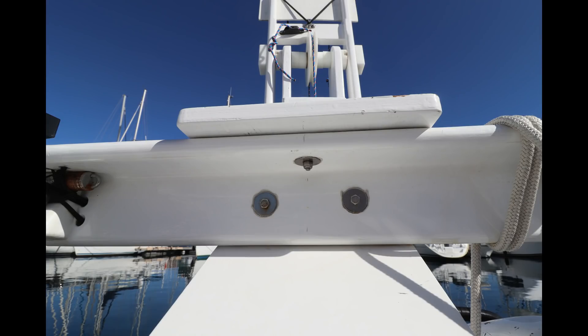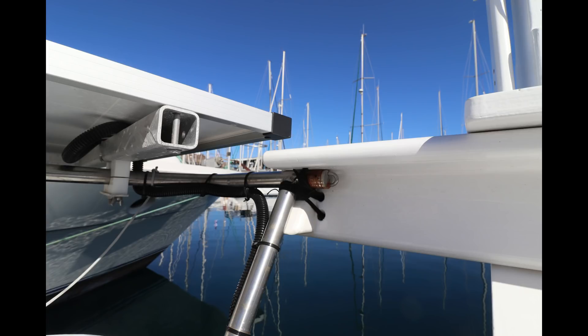When I purchased Wave Rover, the push pit didn't have a continuous bar across the back. So I fabricated a piece of wood and covered it in fiberglass cloth. The base assembly is now through-bolted to this piece of hardwood, which is in turn connected to the push pit by lashings. These lashings are made out of lobster twine — a polyester twine we have locally in Prince Edward Island, about a sixteenth of an inch in diameter. Despite going through two good-sized North Atlantic gales, the lashings are still in perfect condition, just as good as when Wave Rover left Canada.